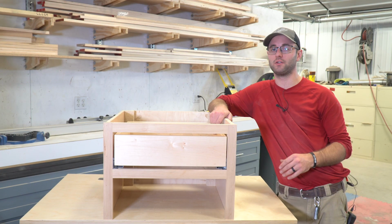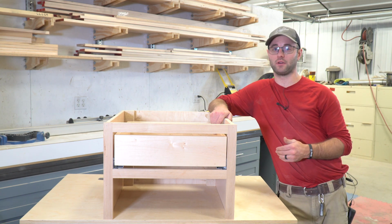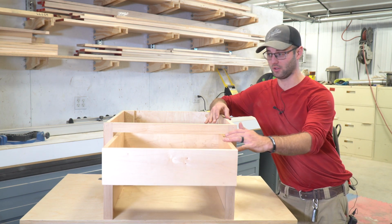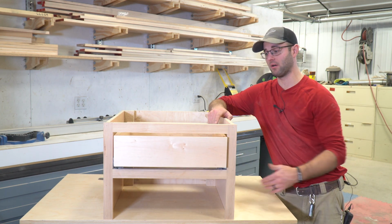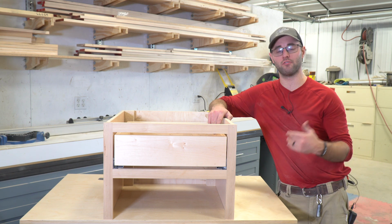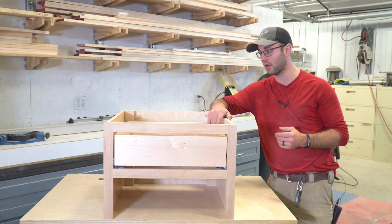Well, after getting a little bit dirty, we have all 3 drawer slides installed, and I can say without a doubt the winner is the undermount slide. It is the Cadillac of slides. The motion and the soft close is extremely smooth and is a step above the side mount slides. You just don't have that tolerance issue you do with the side mount that can at times interfere with the smoothness and the soft close feature of the side mount slides.